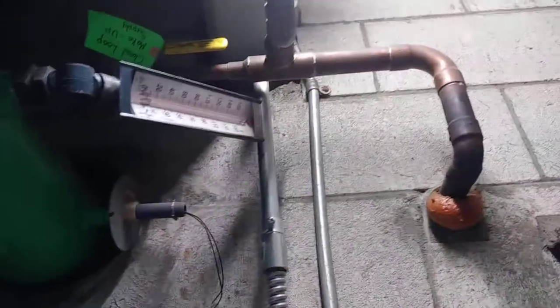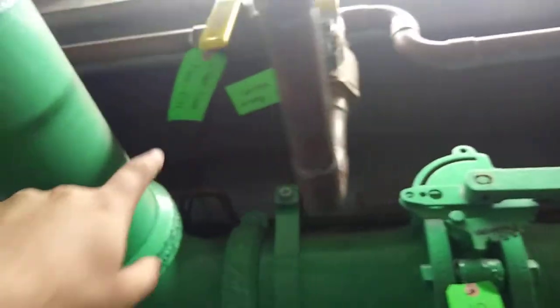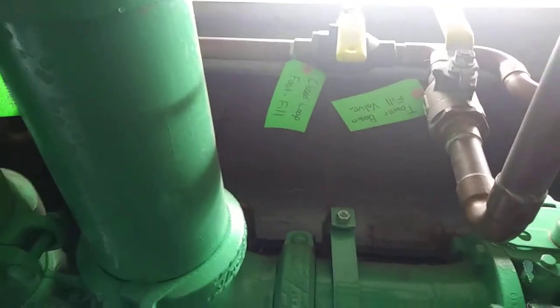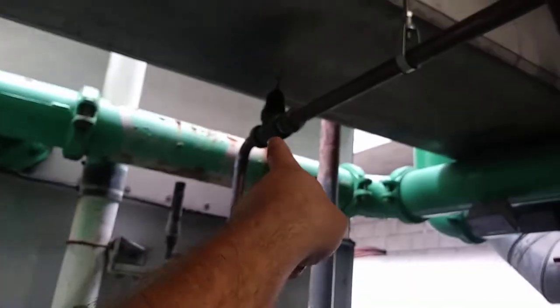You can see where I cut back the original piping — this is the only original elbow left in here. So it went over here for the fast fill. When the loop is completely drained, you open that up and you get city pressure in there — it builds up a lot faster than through the makeup regulator obviously. And this is for the loop valve on the cooling tower, which I also installed the pressure regulator on.